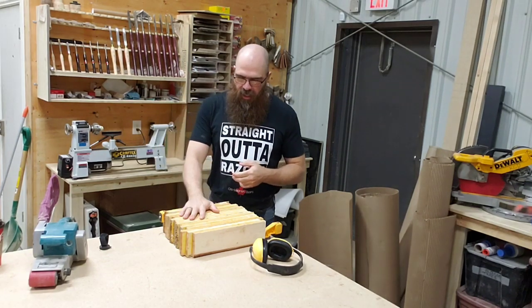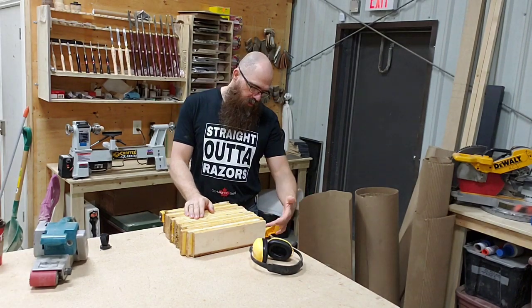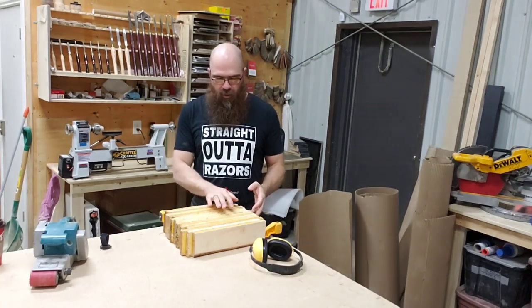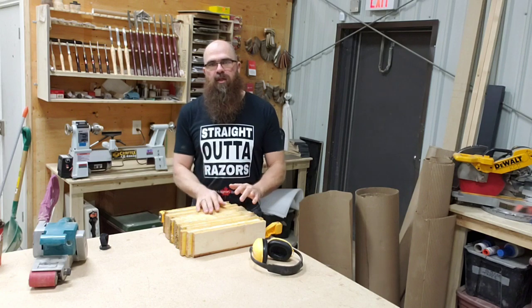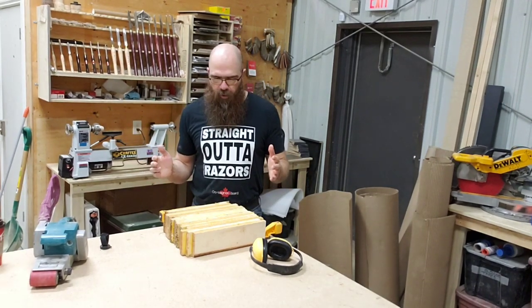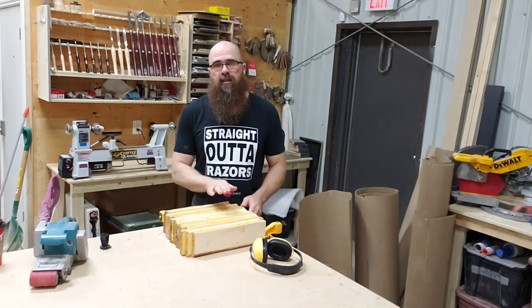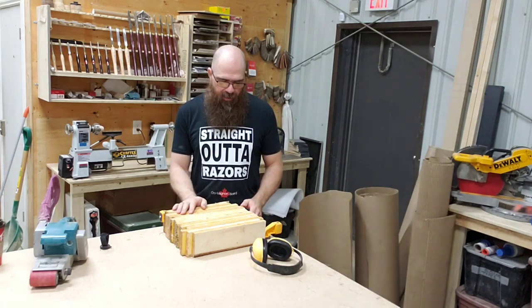So some time ago, we glued this up, and we showed you how to put the happy faces and the frowny faces on to coincide with each other so it doesn't warp. We don't have a 23-inch planer, so we're just going to use our belt sander to get all of our glue off and make this one smooth plane.